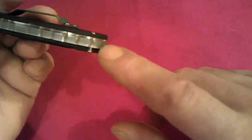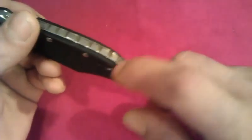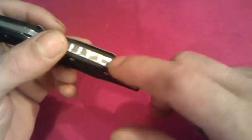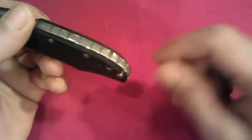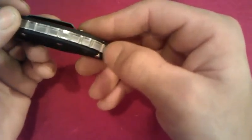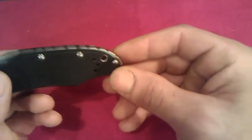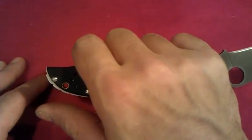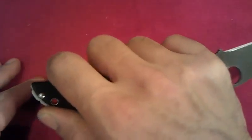The jimping is far from perfect — I have to work on that. I used a Dremel with a cutting wheel to do it. I made marks about a quarter of an inch apart and then cut the notches with the Dremel. They're not 100% there — they look a little bit off — but if you look at the side profile it actually looks pretty damn good. Basically it just adds better grip right here in a reverse grip.